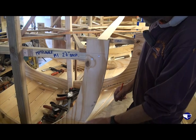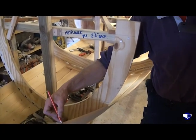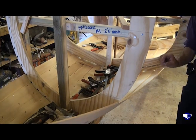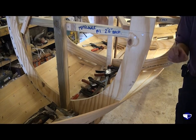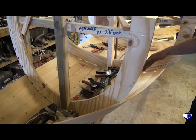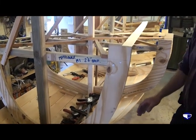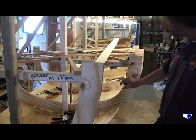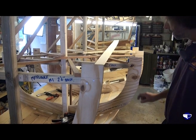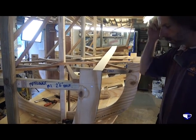From the first mould forward, we tend to just run that out fairly constantly. Once you've planed off some of it, look along the top edge of the plank — if there are lumps and bumps then you haven't quite got it right. Because looking at the planks below, in any decent clinker boat there should be a gradual change of thickness — you never get lumps. It's a gradual sweep of the curve, and the plank above replicates itself on the plank below.